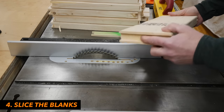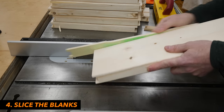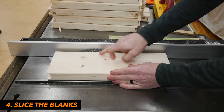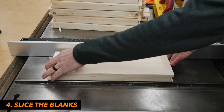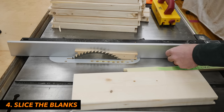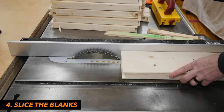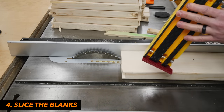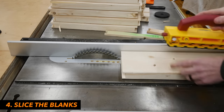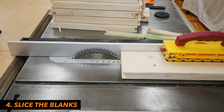Next step: now that we have the top and bottom notches cut, our blanks are going to get sliced into individual rails. We're back to a single one-eighth inch regular blade. Measure the blade height just a little above the wood, and set your fence to the width of a frame. Now we run these through and cut each individual rail off as we go. I'm using one of these grabber push sticks — I've never used one before, but I think it's going to make the job a lot safer and easier. It goes right up against the fence and the blade travels through the opening in the device.